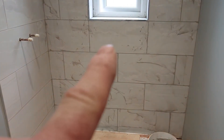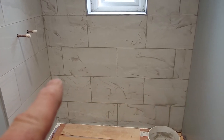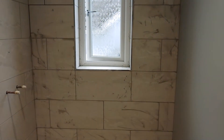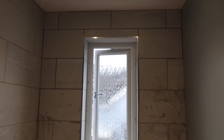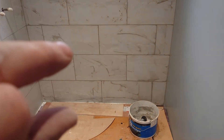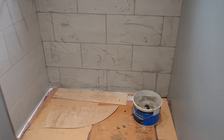Starting from the middle — either a whole tile or a half tile in the middle — and then seeing what cuts are at the sides. You kind of have to figure out what will look best at the end, and where all these cuts come in relation to the bottom of the window, the top of the shower tray, the floor, the top of the window and the ceiling. You don't want to end up with tiny little skinny bits anywhere, so you have to move the tiles up and down to accommodate all those areas where you might get cut tiles.